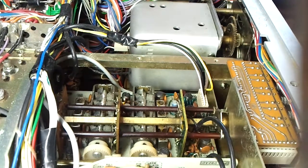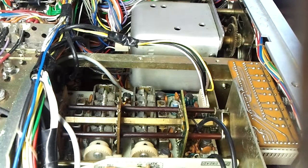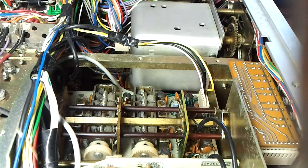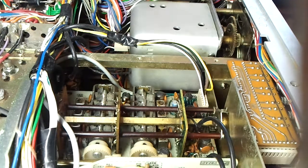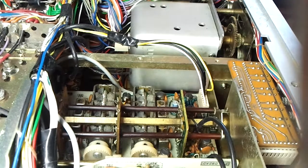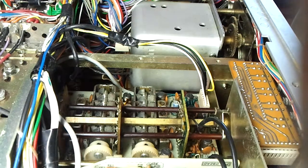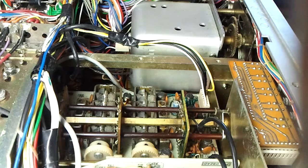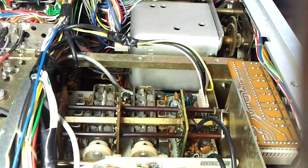Hello again. I've got the preamp board reinstalled in the transceiver and I'm starting to tune it up now, and it looks like it's working well. The instructions for tuning up the alignment are to put the pre-select control at the 12 o'clock position, and then tune the input and the output of the preamp for peak in those positions. I can't show you the signal strength meter and the tuning at the same time, so via a bit of editing I'll try and show you both.